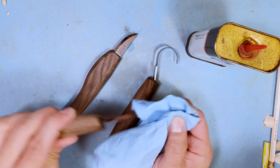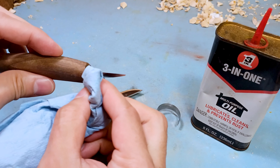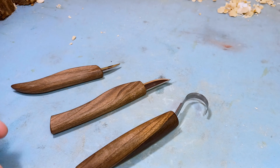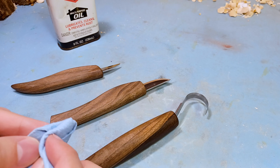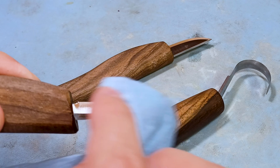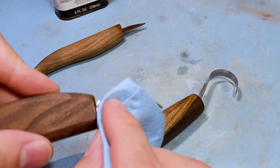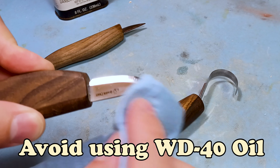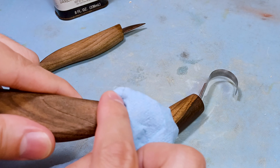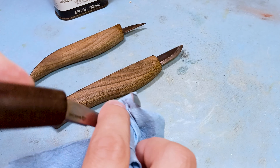Since I'm in Florida and store my tools in the garage, there's still a possibility they might get some rust, primarily because of the high humidity here. What I usually end up doing is getting a little bit of three-in-one oil or any sort of multi-purpose oil and doing a light coat on top of my tools. It doesn't have to be a super thick coat, but I do like to store them wet — this creates a protective layer on the steel. I'd be cautious about using WD-40 because it has some solvents in it; standard maintenance oil like three-in-one is good enough. Just put on a thin layer to help prevent rust.